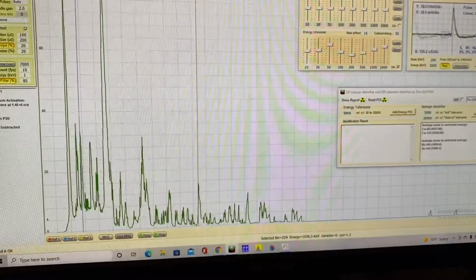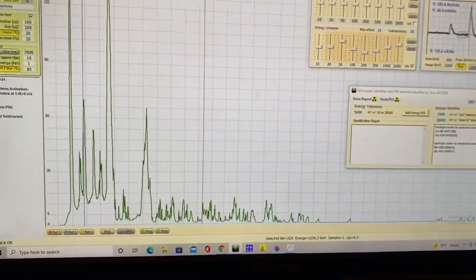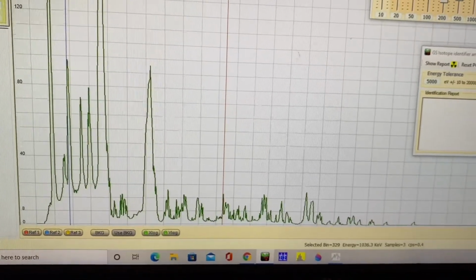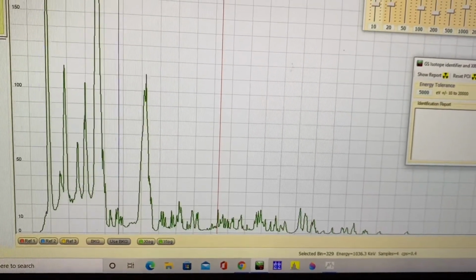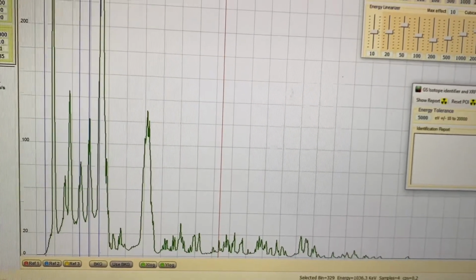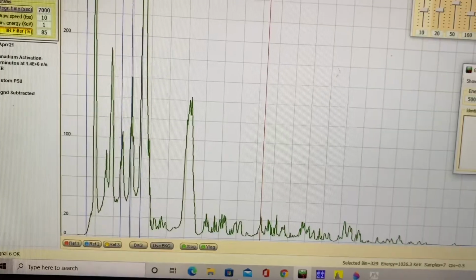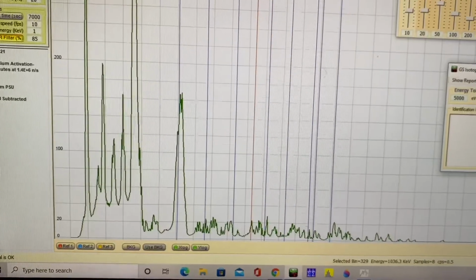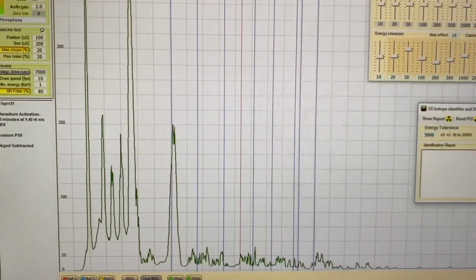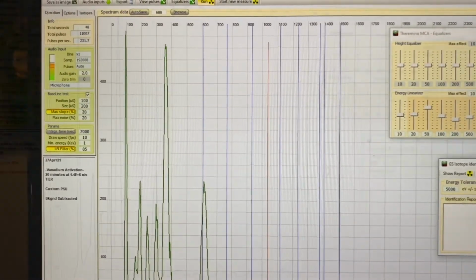Okay, you can already see the radium peaks showing up here. You've got the radium peak here where the blue line is. You definitely see bismuth 214 here, and lead 214. The 3 peaks are going to line up perfectly. Let's see, where's the lead? There we go. All right, so that's all looking pretty normal. Bismuth 214. And let's let this run for a little bit. It's currently at 44 seconds, so we'll be back at 500 seconds.